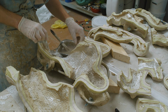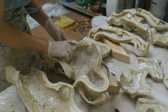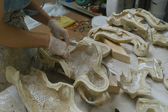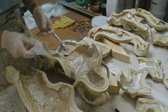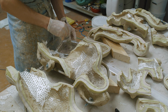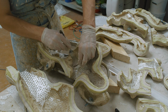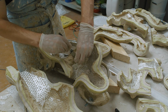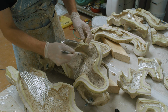This means that, for example, in the portrait of this sculpture, we have filled the ears, the nose, and any other deep crevasses with resin. This does of course mean that the resin is thicker in some areas than in others, so it's not even. The fiberglass would never lay down nicely and evenly in tight spaces like ears, nose, and eyes, especially not on this scale anyway, so we had to do that.